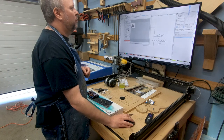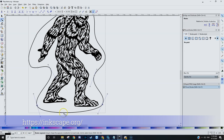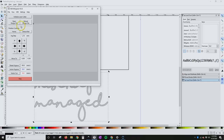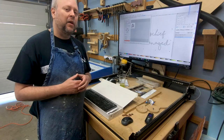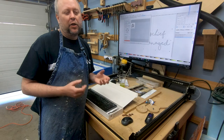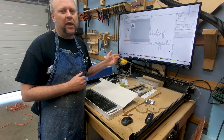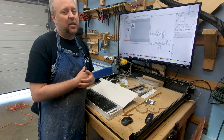I tend to work with SVG files and use a program called Inkscape, which is also free and works very similarly to Adobe Illustrator. It's super powerful and you can do a lot of really cool stuff with it. All you do is save something as an SVG, open it in K40 Whisperer, line up your work, hit engrave, and you're done. There are paid programs like Lightburn that will work with the K40, but the really cool features require upgrading the controller board. So I just use K40 Whisperer and Inkscape, and eventually I'll upgrade the controller for more options.